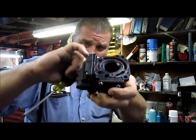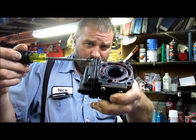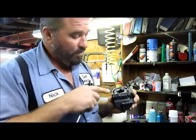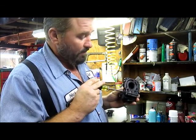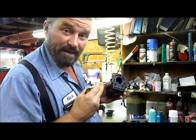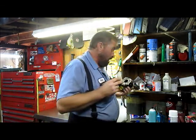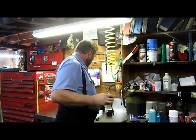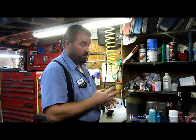This gasket right here, as I tightened it, it wanted to curve down a little bit, so I know it went a little bit too far. As I loosen, it'll straighten back out. The reason you do not need to tighten these too much is that the plastic body of this carburetor acts as if it's a thread-locking agent in itself — these will not back out.